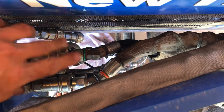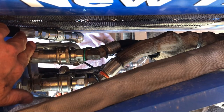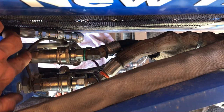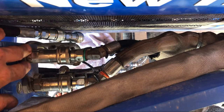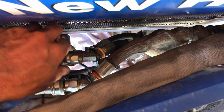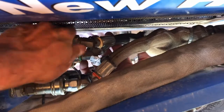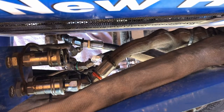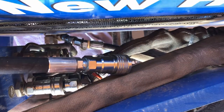On the plug-and-play kit, all we have to do is disconnect these loader connections and plug in the switching valve in line. If you ordered the economy kit, we would actually use a wrench on this right here and remove the quick connection and install it on the end of the loader. The white and green go to the lift function, so that's what we're going to connect for this customer — he wanted the lift function so that he would have float on his rear remotes.